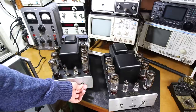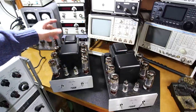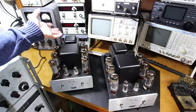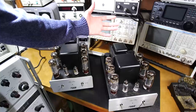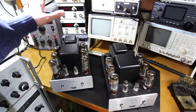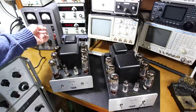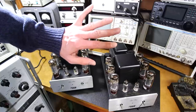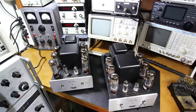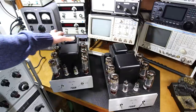Let's go back to the feedback here. The feedback is really a personal thing. When you switch the feedback off, you're going to have a peak in the response pattern. Say the peak is around a female vocalist's voice — it's going to make that vocalist sound like she's standing out from the rest of the instruments. When you click the feedback on, it flattens the response pattern, settling her back into the band. Many people like no feedback. Adding feedback lowers the distortion within the amplifier, and we'll take a look at this amplifier's distortion in a little bit.